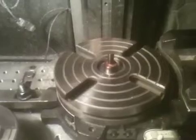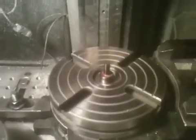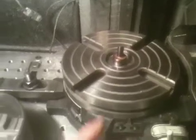And you just simply put it up, and I got a 5/16 collet in it right now. It's not tight, obviously. But you just simply tighten it up in your collet. You can use a drill chuck, but the majority of drill chucks aren't all that concentric, depending on what brand chuck you have. You may have a better one that is, but the majority are not. So you just want to use a collet in that case.